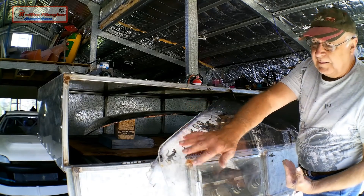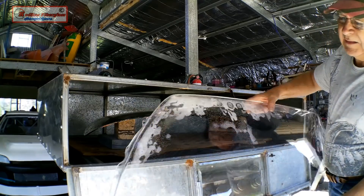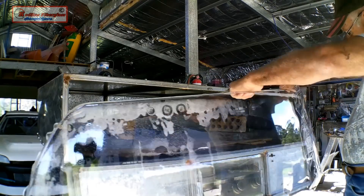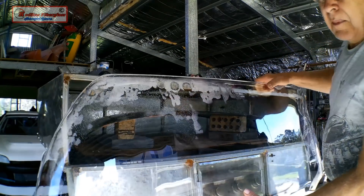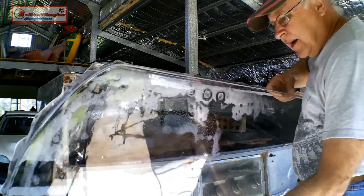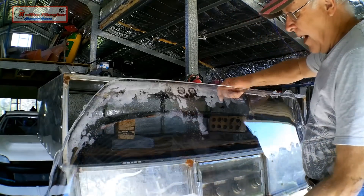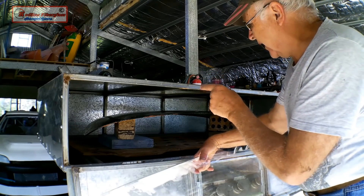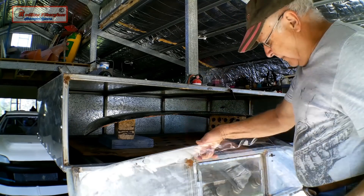There's a little bit of heat bubbling — water vapour bubbling — but it's not enough to worry about on a race car. Look at the way it's shaped itself around that edge. I would say this is giving a better result than drape moulding out of the oven, even with a fibreglass mould to compress it, because it's curved right round the glass and that's prevented it from springing back. My verdict: baking acrylic and Lexan in the oven on the factory glass is the simplest and best way to go.